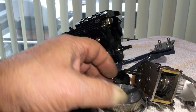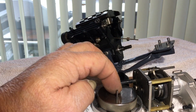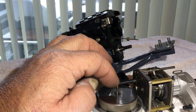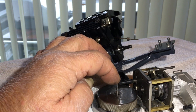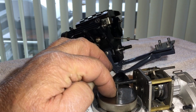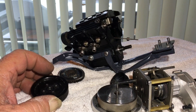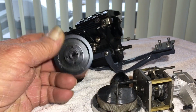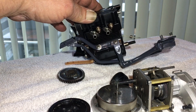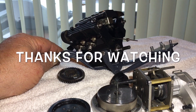That's the simple way to put your flywheel on. Now if you don't have a flywheel like this, go get a regular two-stroke flywheel and still use a 3 millimeter bolt in the center. If you have to shim it with some tubing to center it, once you center it, remove the pins out of your two-stroke flywheel, mark your flywheel, drill them, and then use the pins out of that — put it right in this. That's what I did on my FS100 single cylinder. I wanted to make sure everybody had a gist on how it was going. I got this crazy mount going here so I can fit this into my Capo JK Max. The saga continues and I'll be back with some more builds — adios.